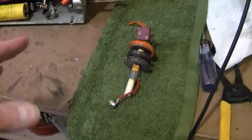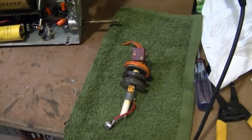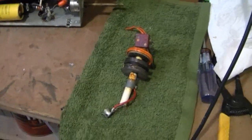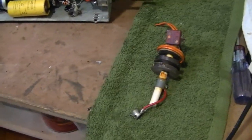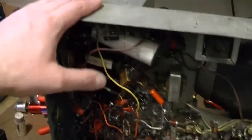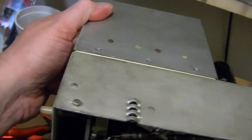Anyways, I think I've repaired it well enough that it should work — maybe with slightly reduced high voltage because of the reduction in the number of turns. But considering how many turns there are, I don't think I knocked off more than one or two percent. I want to pop it into this chassis since this side is more or less working. The question is, how much of a hassle is that going to be?